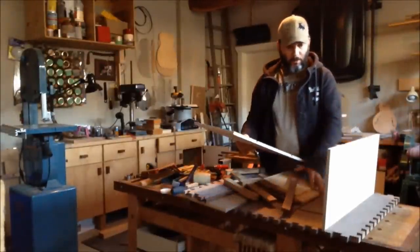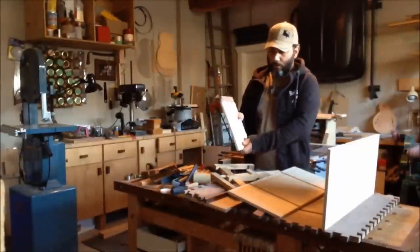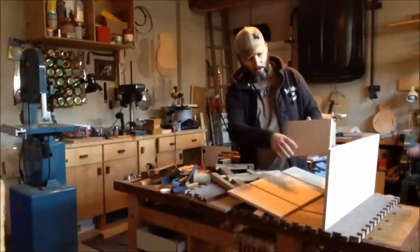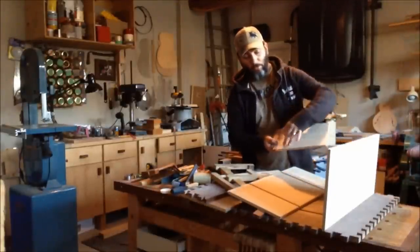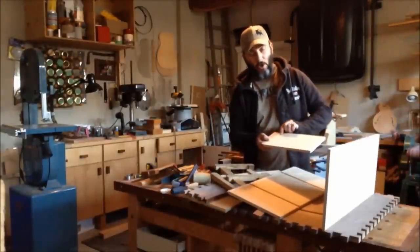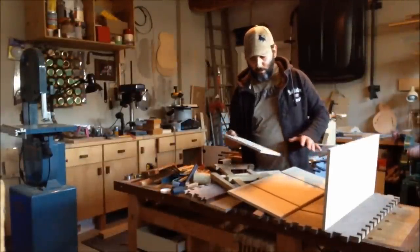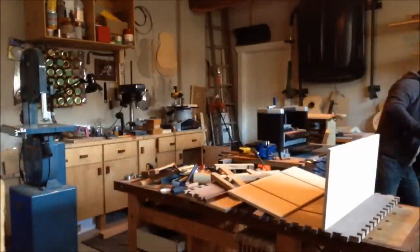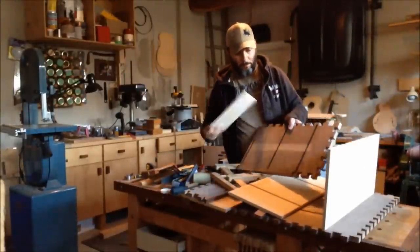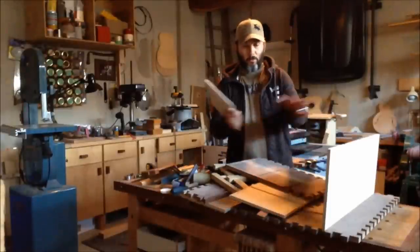The next step is to line up the drawers. On the sides, they go horizontally — I'm going to have tracks for the inside drawers, so two tracks on one side, and three tracks for the two-inch drawers on the other. I'm going to do a quarter-inch recess into those and put some hardwood strips in, then glue them up. There are also tracks on the sides that need to match up with those. So I'm going to have to replicate the same thing there, and once those are done I can glue the whole assembly together.